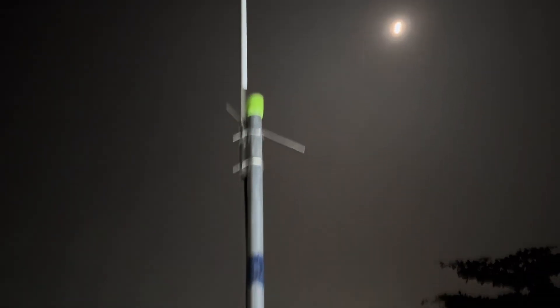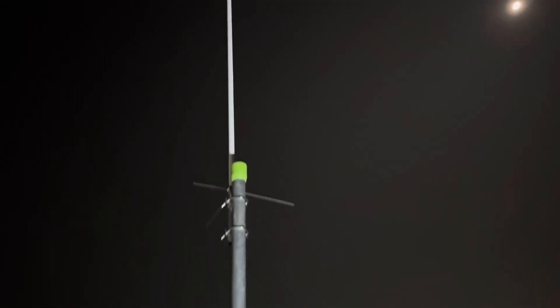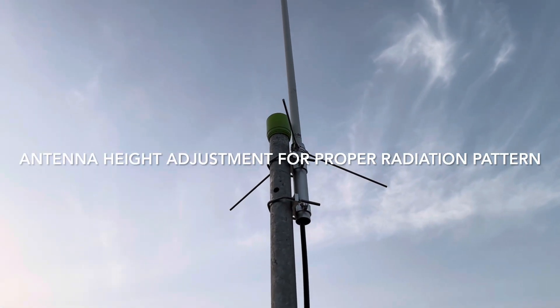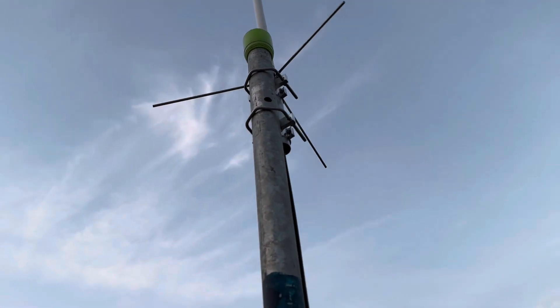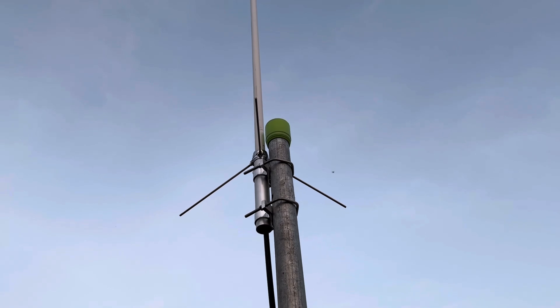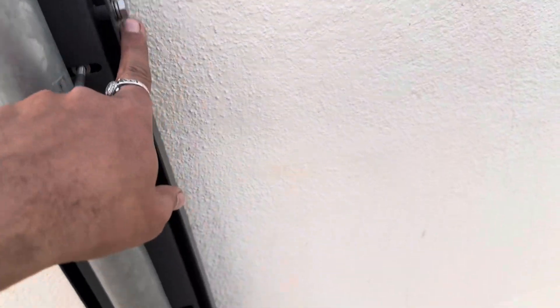The antenna has been erected on the mast and assembled. This is the Diamond X50, and there is a special mechanism where you can remove the two bolts and loosen the bottom so it comes down onto a stool. This makes maintenance work easy. There is an obstruction where the white element is intercepting with the GI pipe, so I'll put it down by opening the two bolts and lowering it as a cantilever to rest on the stool.